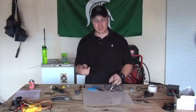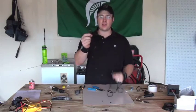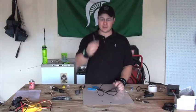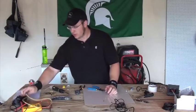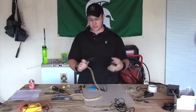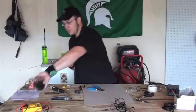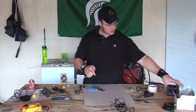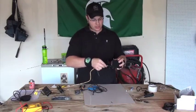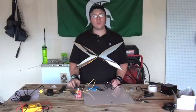Now after that, you should have both your phone plug soldered and hardwired into your device plug, which is going to be the DC female. And then also you should have your foot switch — your normal switch — and that goes into the other phone plug. All of these will go into their respective places within your DC power supply and power the rest of your devices.